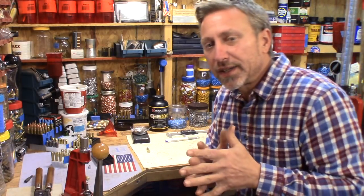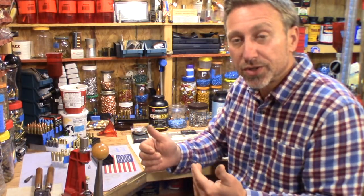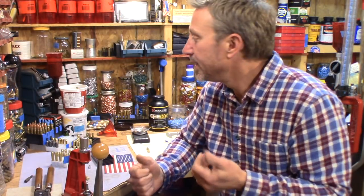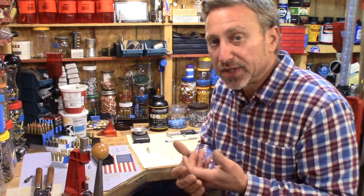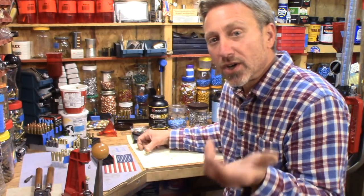But then I immediately see there's not a ton of data for what we do with cast bullets, powder coated cast bullets. As you know, I run them up pretty close to full metal jacket data, and the IMR 4198 is not really in the running when it comes to a full power load, so to speak. So I just used the information that I've already accumulated from shooting my 160 grain bullets with the 4198, and I was getting 1724 feet per second. Now with this 145 grain bullet that we shot today, I gained an extra 100 feet per second.